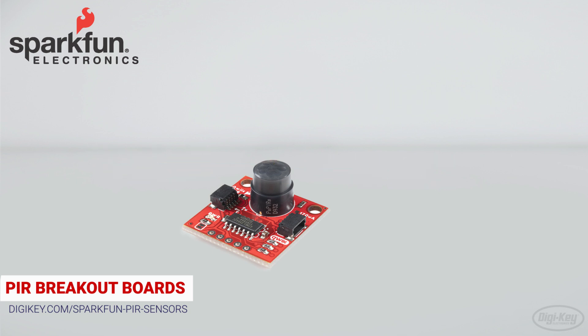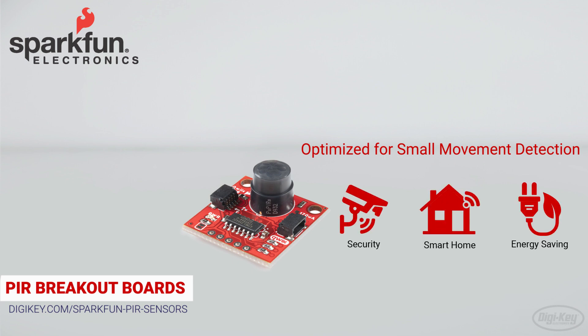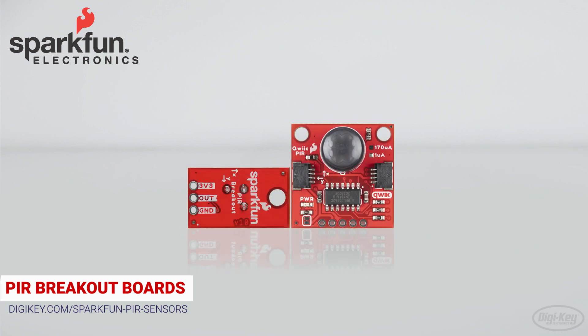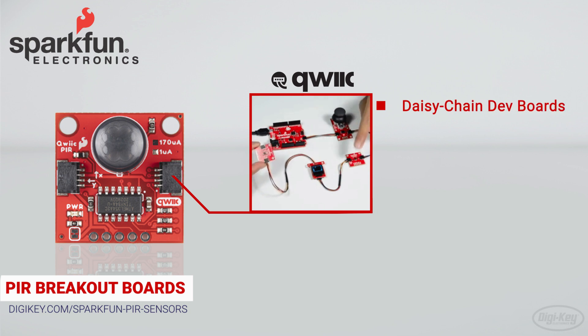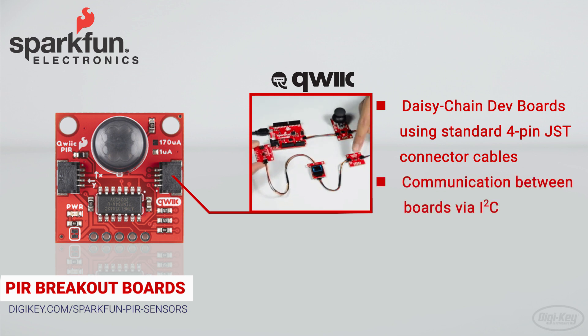The sensors allow a 90-degree by 90-degree detection area with 32 detection zones and a range of 5 meters. The EKM series PIR sensors are optimized for the detection of small movements, making them ideal for security, smart home, and energy saving applications. SparkFun offers either sensor on a standard breakout with breadboard-friendly 0.1-inch pitch through-hole pads, or in a QWIIC form factor which leverages SparkFun's ecosystem of solder-free development boards. Communication between boards is handled via I2C.